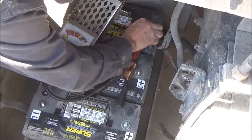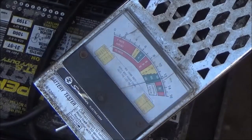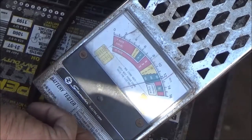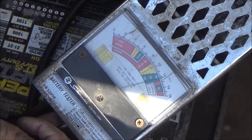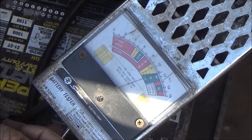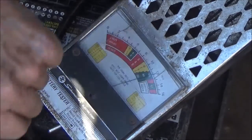I'm going to test this battery in the back first. I'll put my clamps on there with the load tester. I'm showing 12 volts — a little more than 12, maybe 12 and a quarter. The truck's been sitting overnight. As long as it's 12 volts or more we should be okay; 13 is actually better. Now I'm going to hit the switch for the load test — we need to stay in the green zone when we put a load on it that simulates a starter. Just hold it on a few seconds and watch the needle. A little smoke comes out of the top — it gets hot inside when you do that. That battery seems to be holding pretty good.